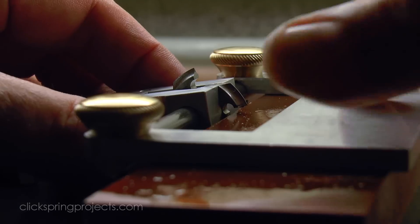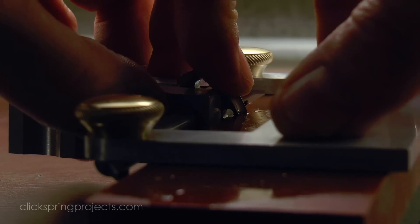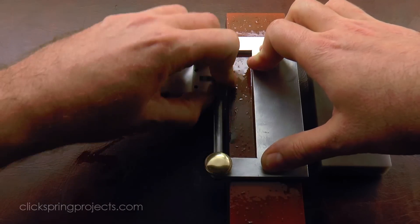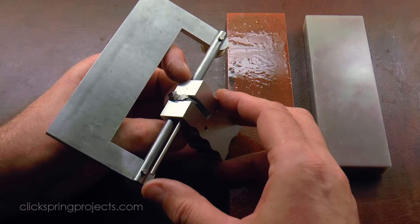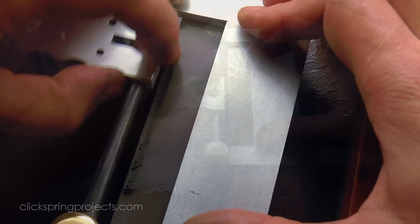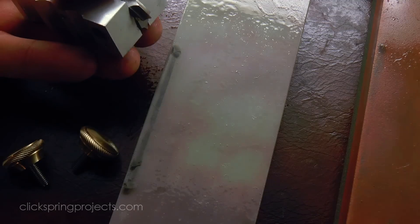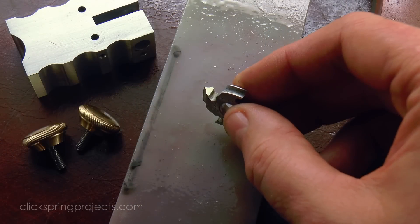In fact, in a lot of respects this tool achieves through its geometry what we generally try to do when freehand sharpening anyway, and so it removes the need to be quite so vigilant about rolling edges. But most importantly, it ensures that the cutter face advances axially towards the stone, ensuring a consistent profile can be maintained across each cutting face as the cutter is sharpened. Now you'll notice that I'm being very careful to not say that the cutter profile is therefore maintained as the cutter is sharpened. As it happens, there's quite a bit going on here that rather complicates that statement. Suffice to say, some sort of profile compromise is a fact of life for all gear cutters, even the commercial ones. And as we'll see in the next video, it generally tends to be a balance between the pursuit of the ideal profile and practical convenience.